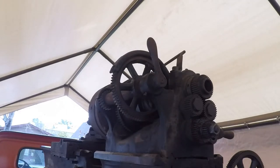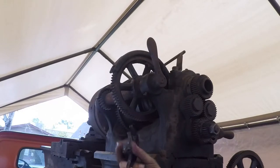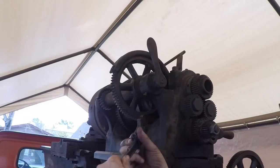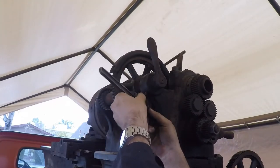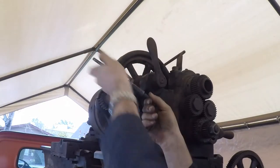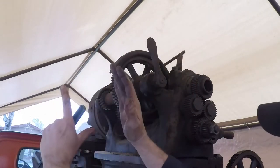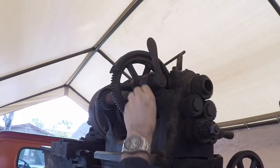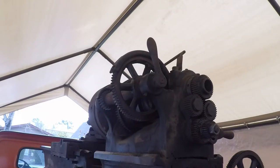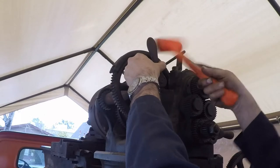Let's see if we can't get this back gear to disengage. I'm going to loosen up this set screw just a little — I don't know if that's going to matter or not. Maybe it just rides in a groove. That's what retains the eccentric shaft. This whole assembly sits on a shaft and when you turn this handle it'll move out of engagement. This is probably just a retention thing. We oiled it up already — let's gingerly tap on this.